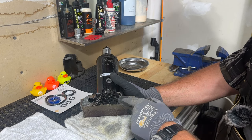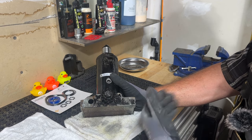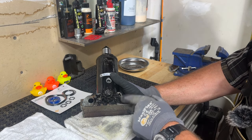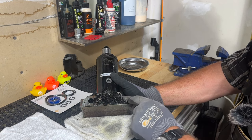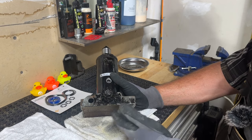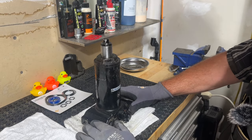Inside here is a metered needle valve set at the factory — we don't need to mess with that. If you take the cover off, there's another cover inside that covers a needle valve and spring that does not need to be adjusted. If the jack is working correctly after repair, leave it alone. But if curiosity gets the best of you and you do take it out, count the revolutions it took to remove it and put it back in exactly the same way.